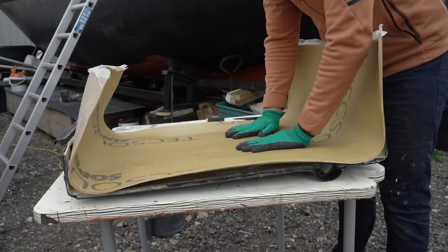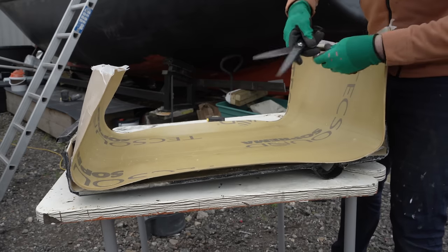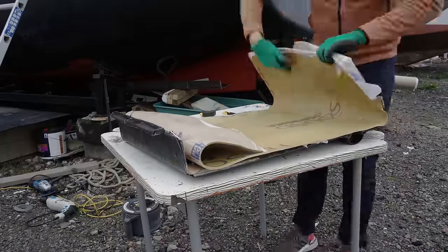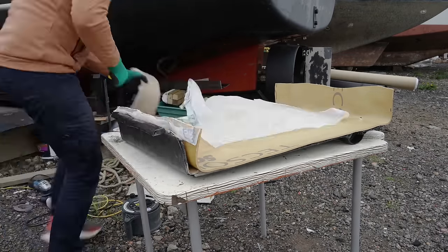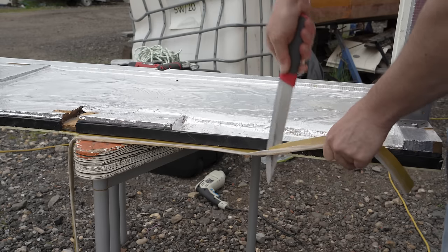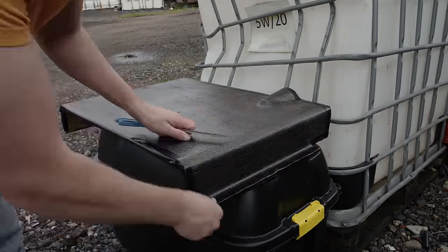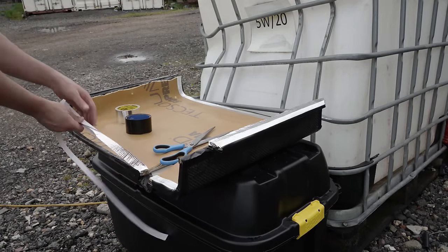During a test with an off cut, I narrowly escaped as I began peeling the film and adhering rather too casually — once the section had stuck down, it was not moving without a fight, so getting things square and without bridging all voids wasn't happening. Having learned from that, I did all the folding, bending and gap punching first to allow for rivet heads, and then sliced the backing film into sections so I could fit the mat in a dignified manner. I left plenty of extra mat around the edge so it could be sliced off afterwards — any miscalculations could mean a gap, and all the booming din of Alan's engine would be free to escape. Here's the slicing technique I used: cutting on the downward stroke caused a distortion wave to the mat, but the upward stroke with a sharp blade did the job. The edges were finished with black edging tape, then kept in place with foil tape, because the combination of fearsome adhesive and a thin conforming foil makes that super useful.